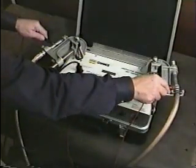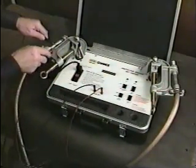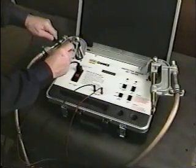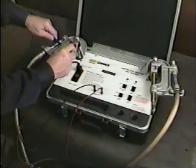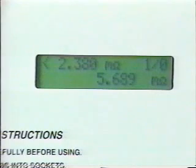Continue probing the cable set from one ferrule to the other, taking note of the resistance readings. Also repeat the troubleshooting process on the other clamp connections. If high resistance is found, you may attempt to make repairs and retest. However, the tester cannot be used to detect problems within the cable stranding away from the ferrules, because those problems often are intermittent, depending on how the cable is flexed.